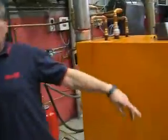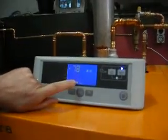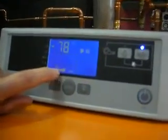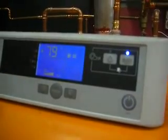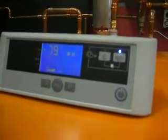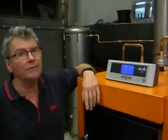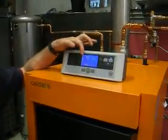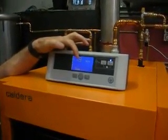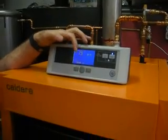The fire's still going in the boiler, but the fan will start to modulate back a little bit, and we can see that that's happening already. There were five blocks there, and that little symbol indicates the fan speed. So that fan is being ratcheted back now, and the reason for that is that the control system knows we're approaching 80 to 85 degrees, so we're starting to slow things down.